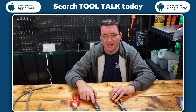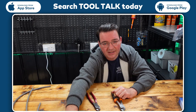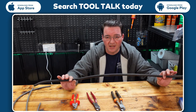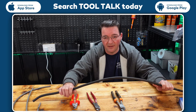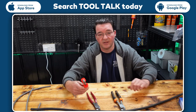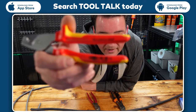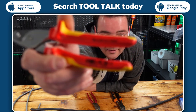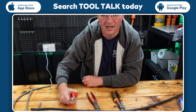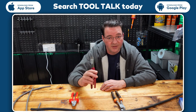Let's give them a bit of a roll and see how well they actually do on probably the outside of the size range I can stretch to. I would love to use SWA because that would really show how well they can cut, but the only problem is — as it says on the Knipex if I can get the focus — 'do not cut steel.' That means unfortunately, unlike the cheap ones, I can't use these for SWA or cutting screws.